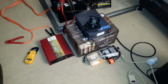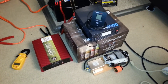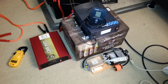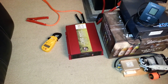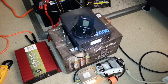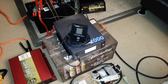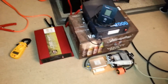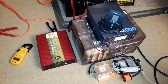Power factor is managed differently between these two inverters, and the voltage amp rating is very different between them. I find that the Tiger Claw has voltage amps much closer to what you get from utility power. I'm going to show you a comparison using my kilowatt meter with two powered speakers as the load, so you can see the difference of the same load off each inverter.